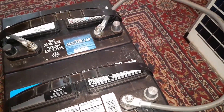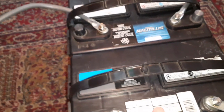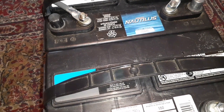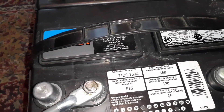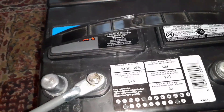I'm back on the parallel setup because most applications — pop-ups or whatever — you're going to be using the parallel setup to keep it 12 volts. Just to show you how small the system is: 65 amp hours times two is 130, but you can't bring these batteries below 50 percent. So 130 amp hours divided by two is 65 amp hours usable. If you're burning 5 amps per hour, you're looking at about 12 hours before you've brought these batteries down to 50 percent.